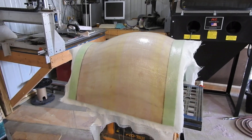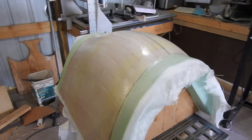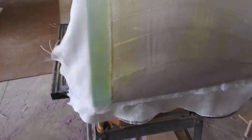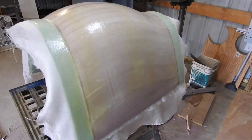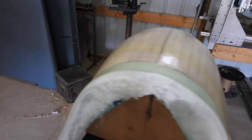I got the two layers of cloth on. The first layer was some scrap fiberglass cloth I got from a friend — a fairly coarse weave, kind of thick. Surprisingly it ended up taking two cupfuls of epoxy to wet out, that's four ounces of epoxy. So I took two coats of that.